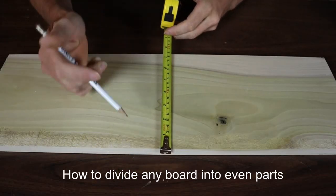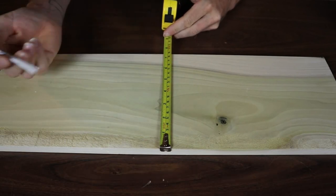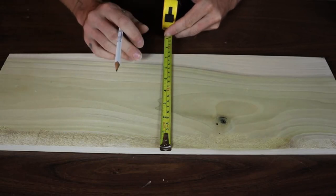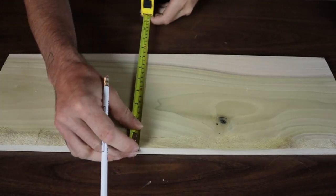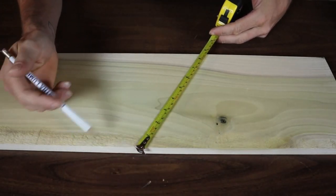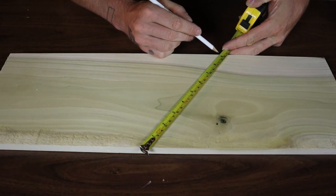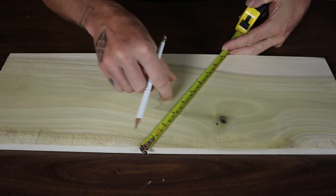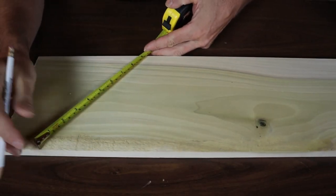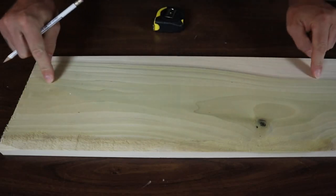Here's a board that appears to be about 7 and 9/32 of an inch. If I want to divide this board into even parts, breaking down that odd measurement into fractions is nearly impossible on a tape measure. Here's an easy way: take your tape measure and angle it across the board, then pick points. To divide into three equal segments, pick a number that 3 divides into — say 9. Angle the tape until 9 inches hits the far edge, then mark at 3 and 6. Now you've got three perfectly equal segments.